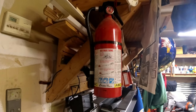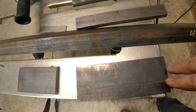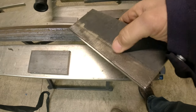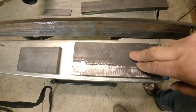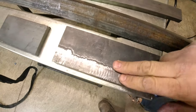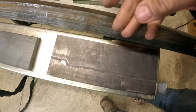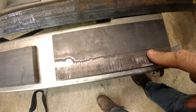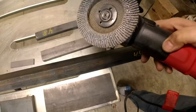One of your key safety items is a fire extinguisher. Anytime you're welding steel, you want bright metal. This mill scale takes a lot of energy to get through — it'll weaken your weld. When you're trying to lay down a weld through mill scale, rust, or anything like that, it takes a lot of energy and could severely weaken your welds. Make sure you use something to get the scale off.